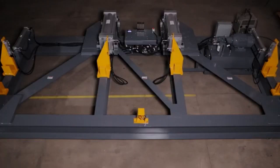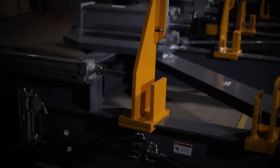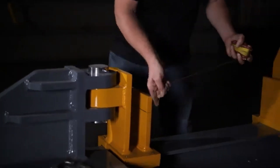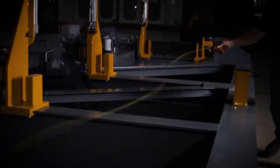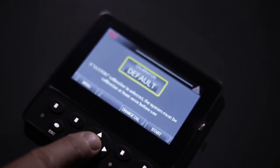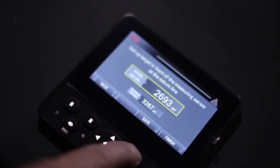The first step is to confirm the calibration of the datum line. If your machine doesn't have the 36-inch stroke cylinders, then insert your smallest spacer tube. Set a string line across your two end stops — this is your datum line. Place a target at the line for your CMS-01 measuring system to read. Now simply go to your calibration menu on the operator's display screen and press calibrate to set this datum line for future calibrations.